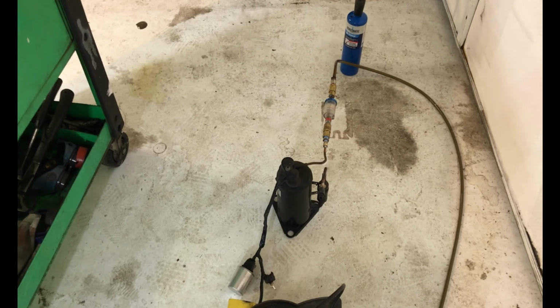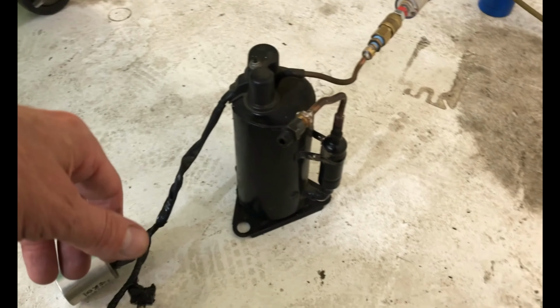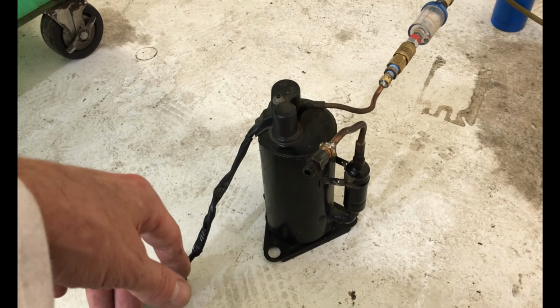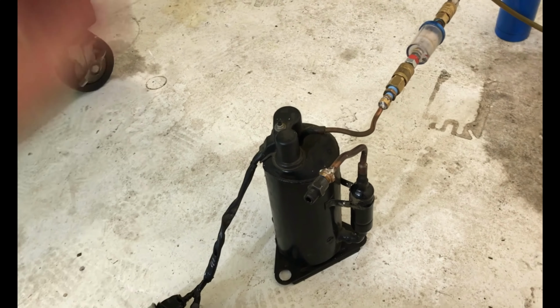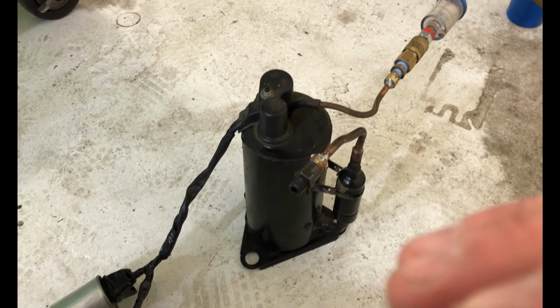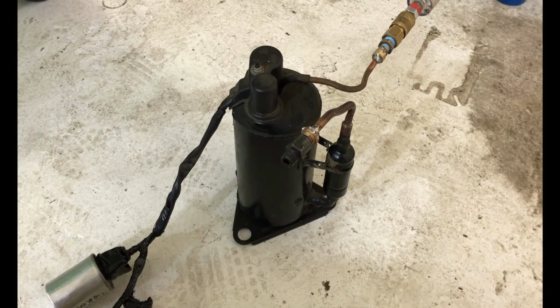Another YouTuber by the name of Tesla88 or something, I can't remember. He's a famous YouTuber now, but at the time when he sent me the video, he was not. He took one of these apart and showed us why they rattle with zero pressure, and why they require back pressure to work. I'm going to try to find Tesla's real channel name. He's a huge channel. The guy's a freaking genius. He's an engineer. He showed us why these need a little bit of back pressure before they'll even start pressuring up. They just won't do it because the air vane needs back pressure on the needle to hit up against the sealing surface.